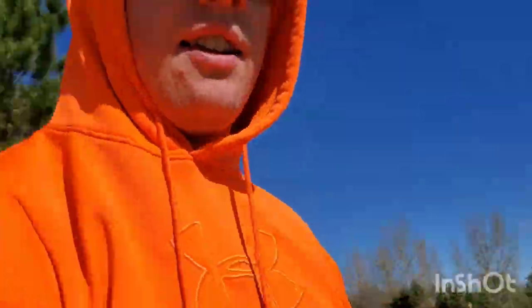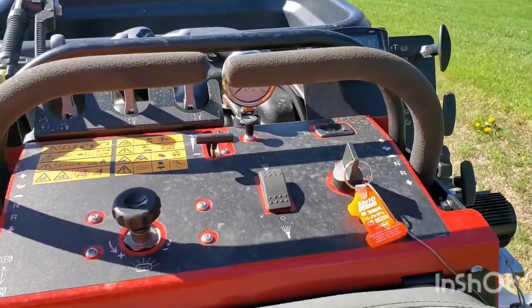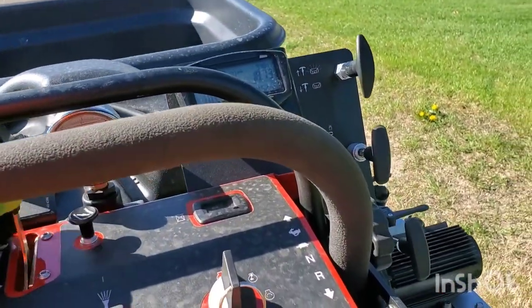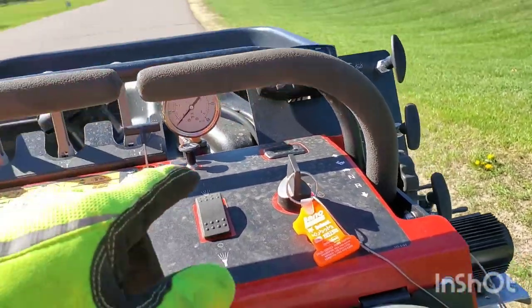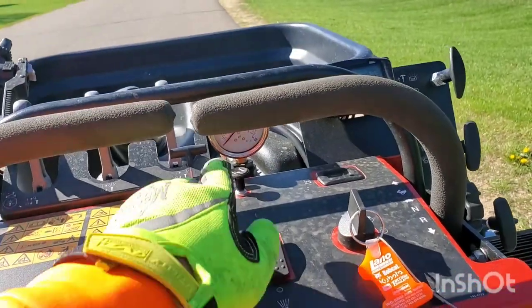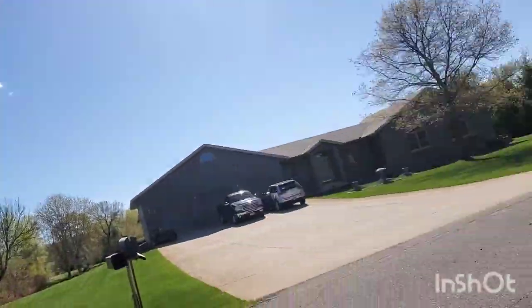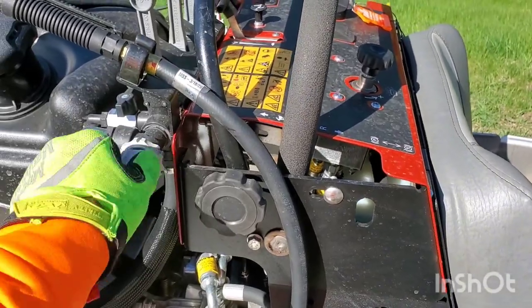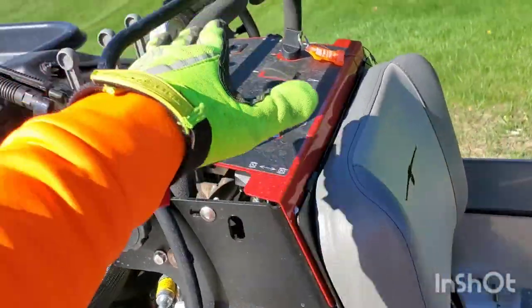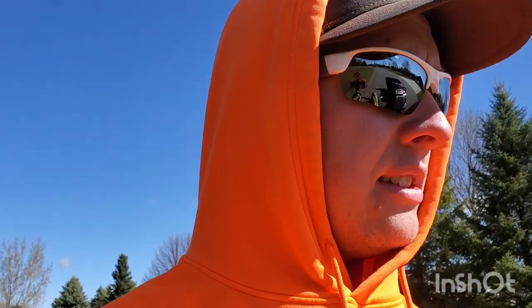A few important things to get the best results: make sure the throttle is all the way forward, or really close to it, because that's going to change your pressure. You want to make sure we're between about 30 and 40 PSI — that's where I get the best results. You can adjust that on the Spray Master or Z-Spray by turning this in and out to adjust pump pressure. Consistent speed and pressure are key.